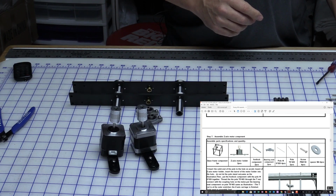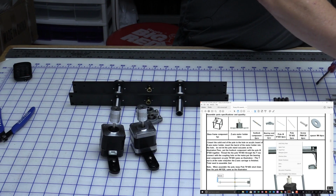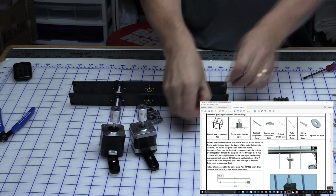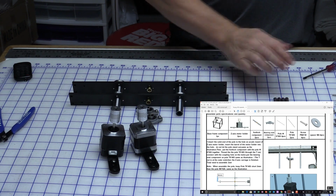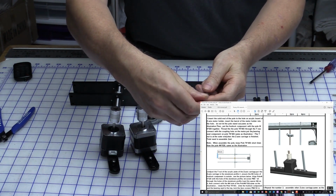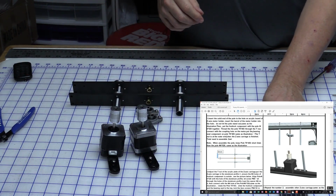Okay, assembling the Z-axis motor component. So all the pieces we just assembled, we need 4 spacers in addition, I think. 1, 2, 3, 4. You need 4 M4 by 20s, and bearing seats we got, foot lock we got, and we got all the poles. I think these screws are for the end of the shafts here to screw it into the V-slots.